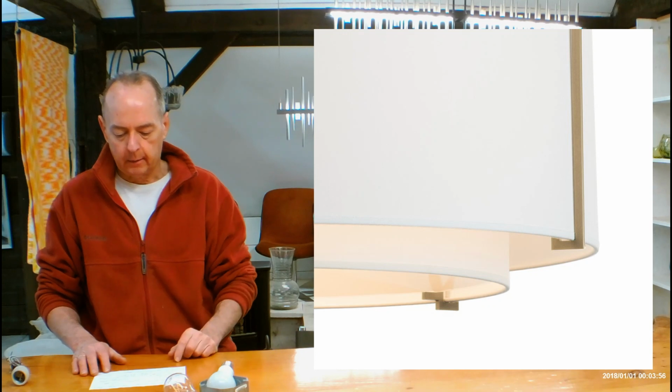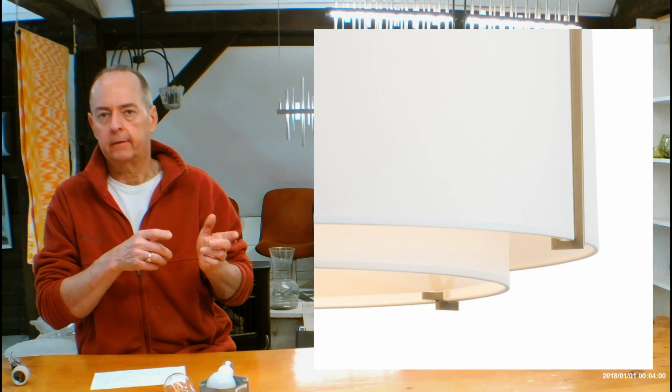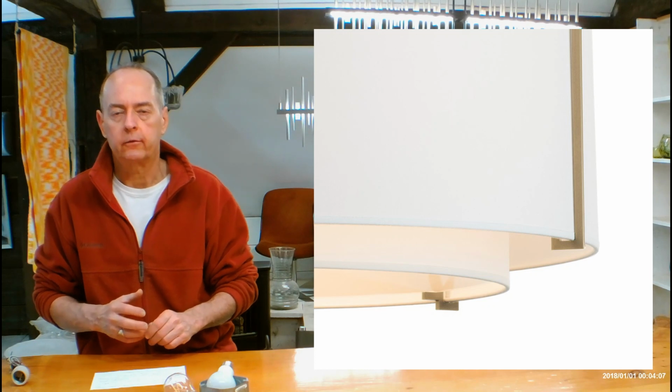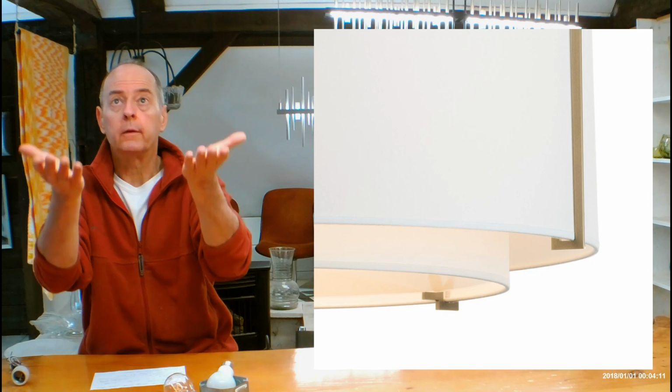Some people don't like that. I'm kind of one of those people. Way on the other side, like I said, 2700 Kelvin. That's going to be super yellow, so that may be nice for some people, but what we like to use in our showroom is called warm white or soft white, and that's going to be 3000 Kelvin. That mimics the nice warmth of an incandescent bulb.